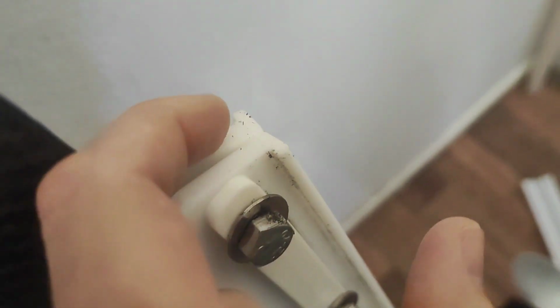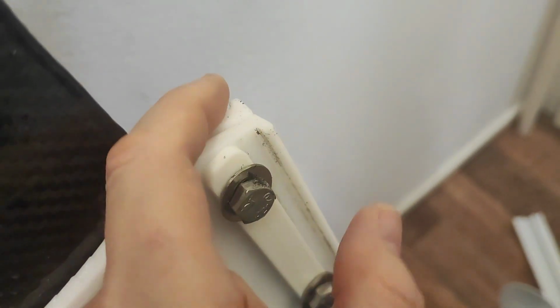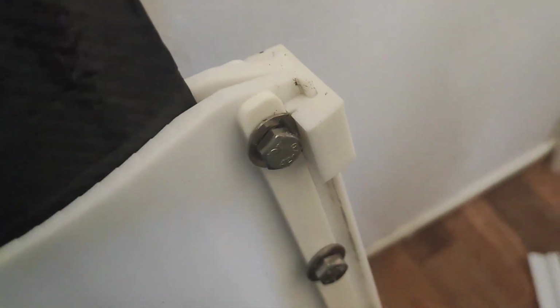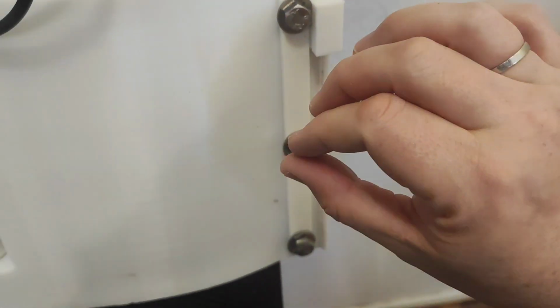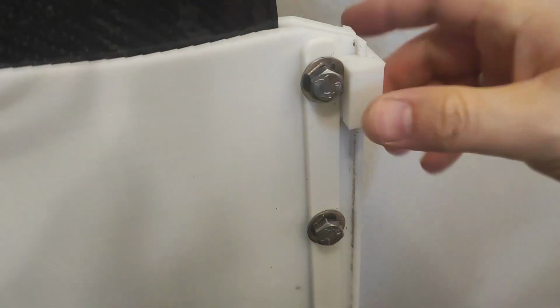Then when I reprinted this, I created these wings out here. The idea is that I will be able to put something like this, and it's printed in this direction because I want it to be like a U-lock around here. This slim thing you see here, I want it to lock around here so that the plastic that maybe wants to go outwards is held in compression. So I didn't print it like a lock biting inwards. I put it like this.